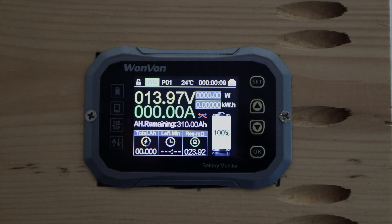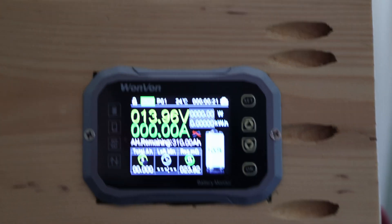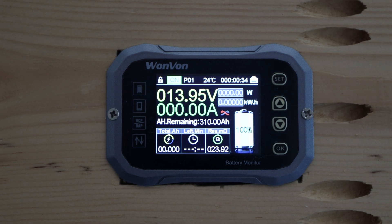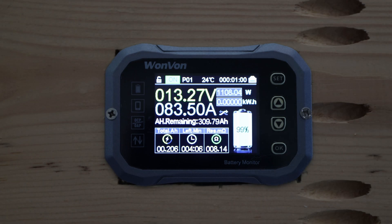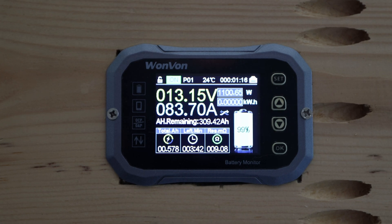The battery is fully charged — you can see the voltage dropping as proof. We should draw around 62 amps, which is the correct 0.2C rate, not what the manual says. At that rate it should take about five hours until the battery is empty. I've started the capacity test; the load is a little higher than expected initially but will adjust, so I'll let it run and we'll be back with the results.